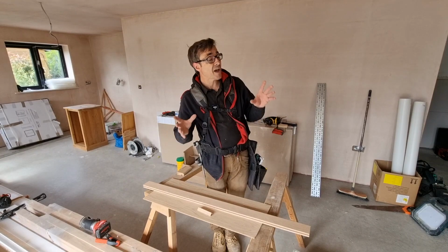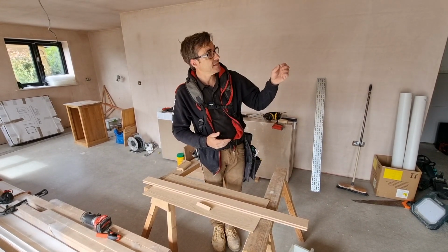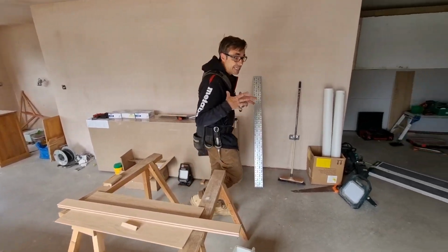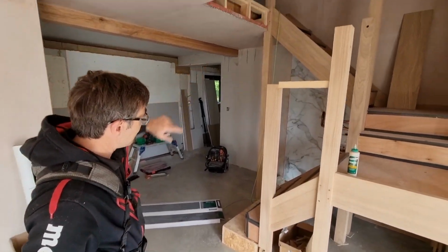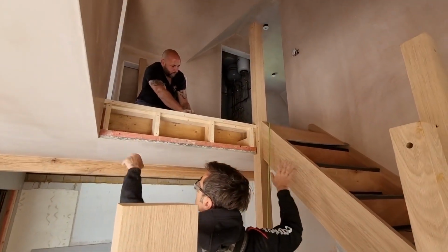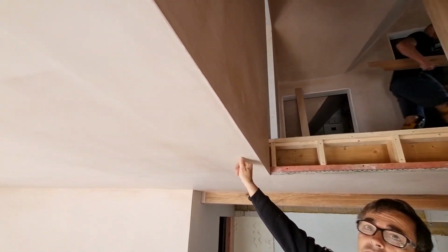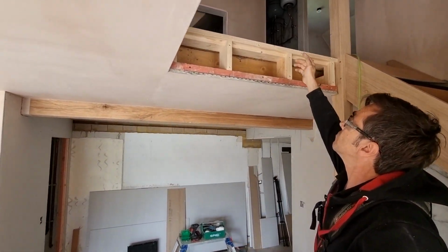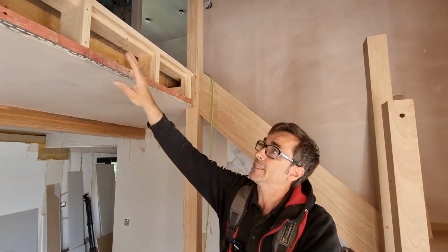So, as part of our second fix, or the next step of doing the staircase, we're running the apron lining through. The apron lining is sold as a separate package from StairBox, and it basically means anywhere you're closing in the joist construction. On this side we have a wall surface which meets the ceiling surface, so it's all decorated in. But on this face, because we're joining to the floor and we have a balustrade, we want the same detail as the nosing repeated here.